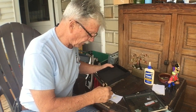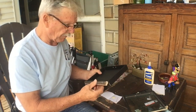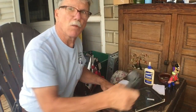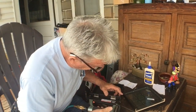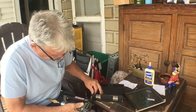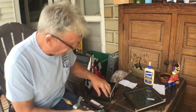This is just something that he had for his rock collection, and I guess through use and abuse of a small, pretty cheap object here, it came apart. So now what we're going to do is hold this up there and shoot a 1-inch pin nailer into it. This is my Hitachi pin nailer. I'm going to shoot one in there and one in there, and come over on this side, shoot one there, one there, and since this has a lot of pressure on the outward part of the hinge, we're going to put 2 in the other direction as well.